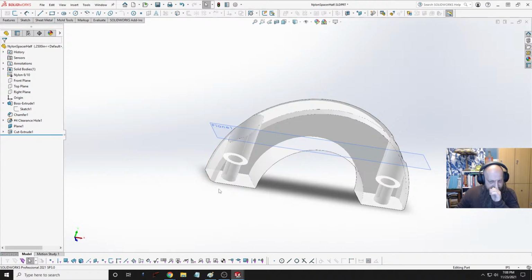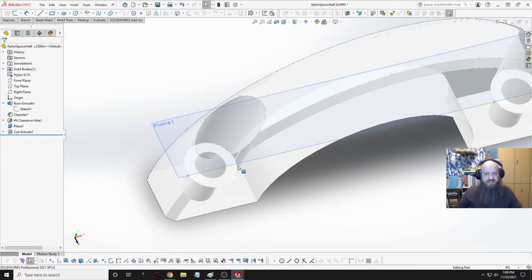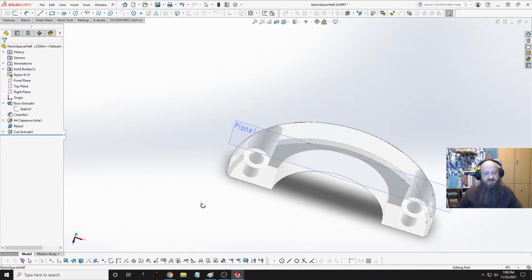Now, what I need to look at is the nut on the other side. So, okay, what this is going to have to be is the top. I'm going to have a top and a bottom. So the top is going to have this feature, and the bottom will have a smaller diameter hole as the receiving, and what I'll use is a self-cutting screw so that it draws them both in. Kind of like a tech screw if you've ever done sheet metal. If you haven't, don't worry about it, it's fine.